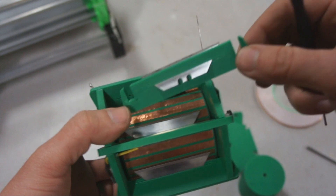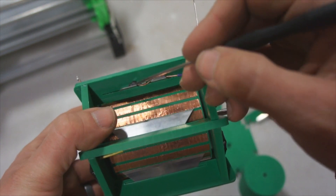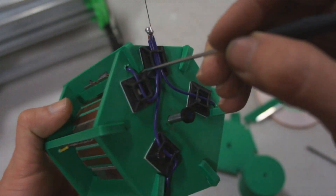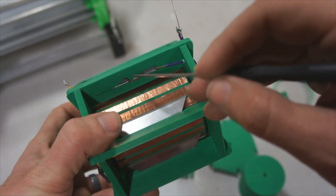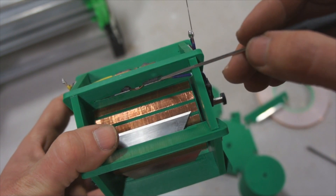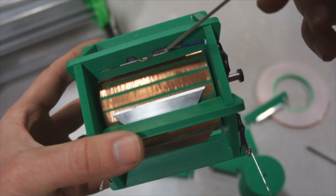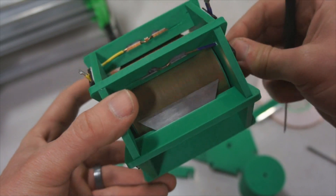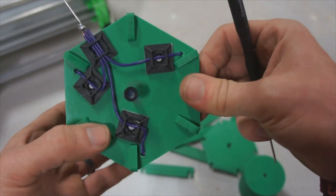As far as connecting the wiring, there's a very convenient feature with the utility knife blade. You've got these two cutouts — take the wire, run it through the cutouts and do a little jog, then come out the hole on the side. You can pull the wire tight under tension, then bring it over to your final outputs. The wire will hold just with the tension. I then put wire glue over the wire — that's a graphite-based adhesive. RadioShack sells a wire glue; I'll put a link at laserhacker.com. The construction details on this motor are incredibly simple — there really isn't anything overly complex or hard to build on this mini Atmo motor design.